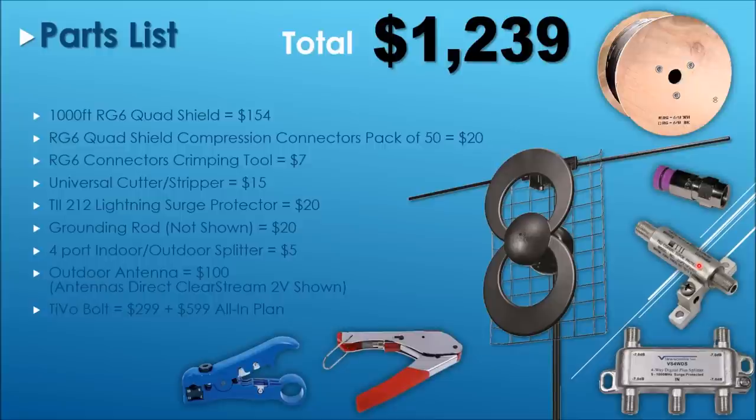And for those of you who are thinking to yourself, well, I can just skip that step, that's not really that important, I just want to get hooked up and let's get it going. Please don't skip this step. That is if you don't want to be buying new TVs and DVRs and all these other electronic components every couple of years or so, because your tuners keep failing due to the static buildup in the antenna from the wind blowing by it. As crazy as it sounds, it is possible. And this will dissipate that charge into the ground.